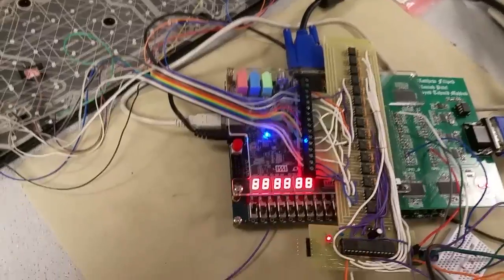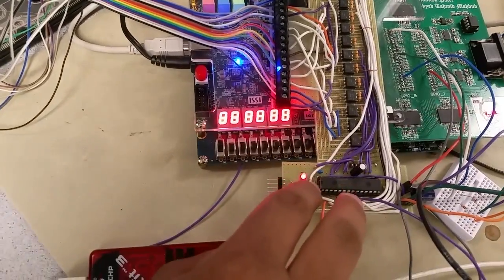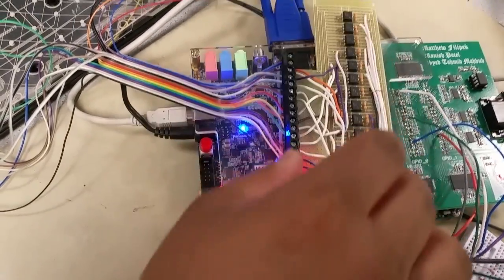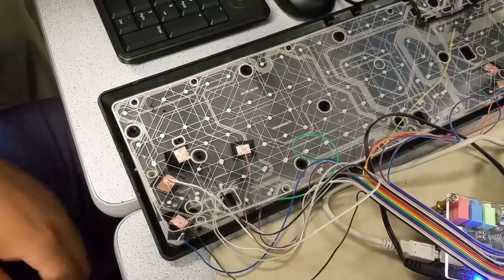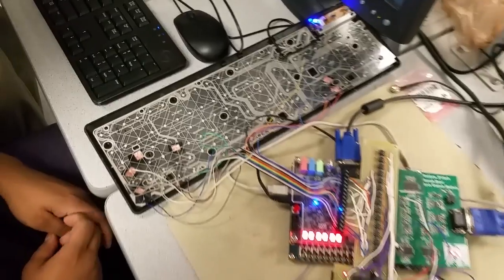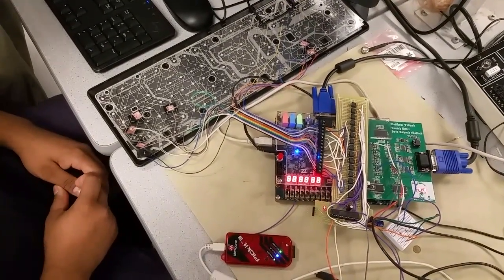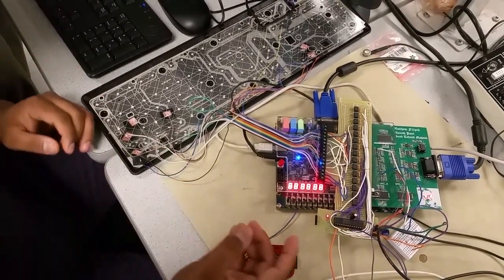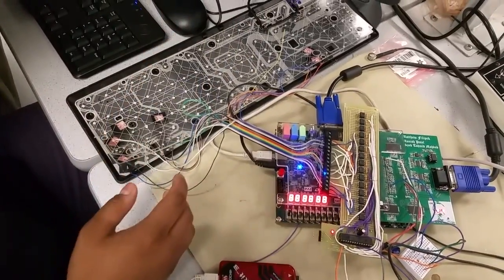And then the output of the FPGA feeds back over a serial communication line onto a microcontroller that uses optic isolators to simulate button presses on a keyboard. So this is a hacked open keyboard. Yep, a standard desktop keyboard. We hacked the matrix keyboard to short the switches as required. And the FPGA also drives a VGA connection that goes out to this monitor.